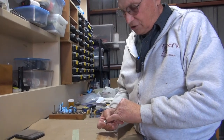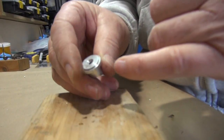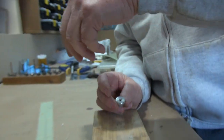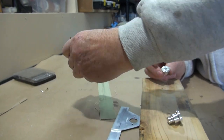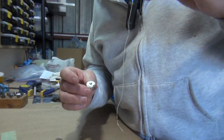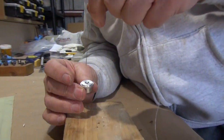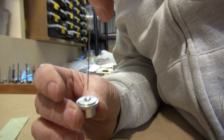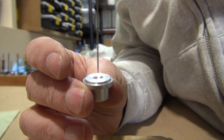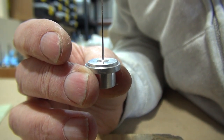The modification to this piece allows the magnet to sit in deeper, which gets it closer to the surface. The further away you get from the surface of the magnet, the more the field spreads out. I determined that the easy way to find the center on the other side was by using just a standard steel sewing needle on a thread — it centers itself right in the center of the pole on the magnet.